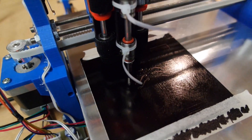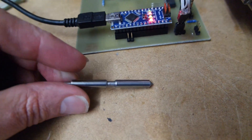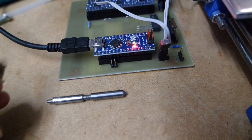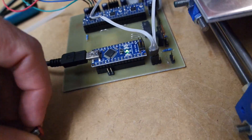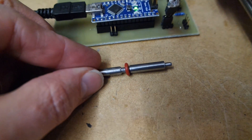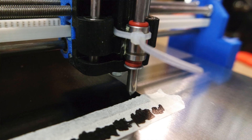I've got something more — I went out and machined one of these chisels. Actually I made two of them. They're very simple: just a steel rod with a tip at the top and a small gap in the middle. When I put them together I put several rubber washers in here, and as the chisel is moving up and down it's actually moving into a limit, which makes it a little bit springy, so I don't actually break anything on the PCB.